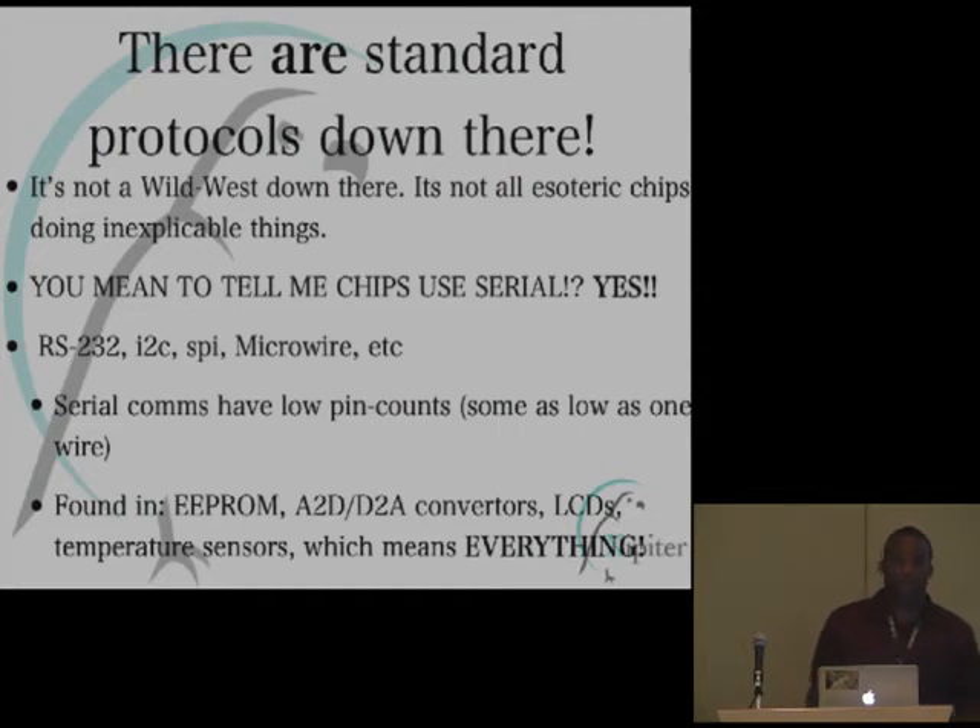The ones I discovered were I2C, SPI, and Microwire. Specifically SPI and I2C tended to be the ones I ran into most in different hardware things. I2C and SPI are extremely ubiquitous — used everywhere. When I built my sniffing rigs and started looking, I ordered accelerometers and all these things use I2C and SPI. I was ordering all kinds of little ICs and chips off SparkFun and DigiKey and just sniffing the hell out of them. Everything uses this stuff.